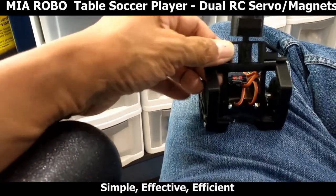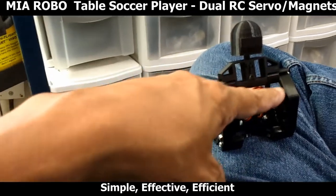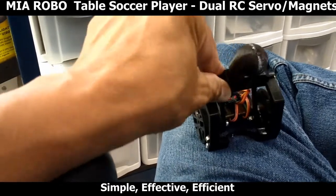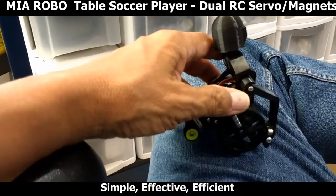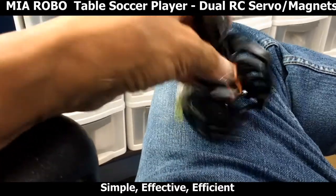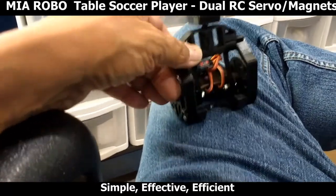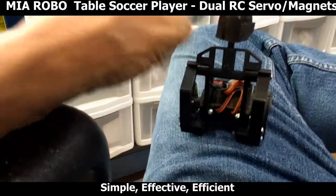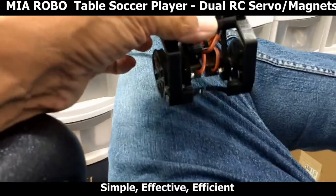What else can I say? You can see the body. This is just a piece that acts as a spreader or distance block, but it's able to pivot forward and backward under pressure of the screws here. Depending how tight these screws are, it's able to hold in place, but it also holds the brackets that are holding the pivots for the legs in that separation, so that it's able to operate nice and smooth.